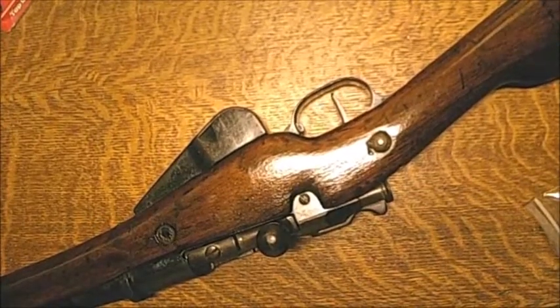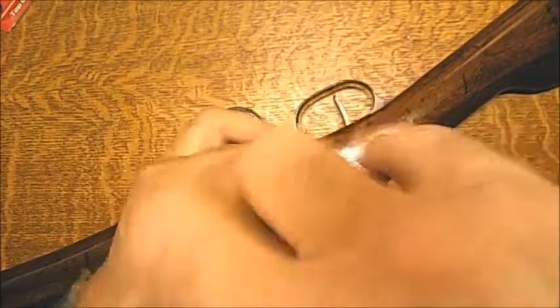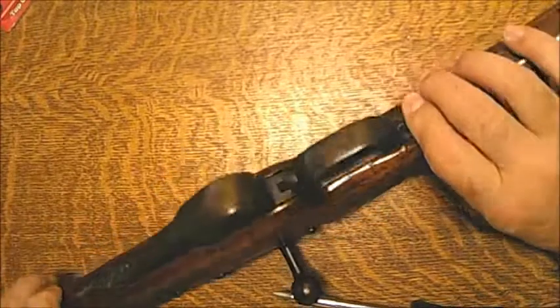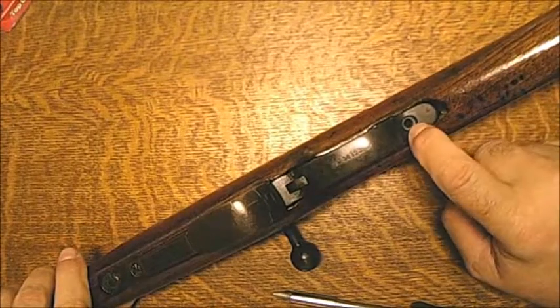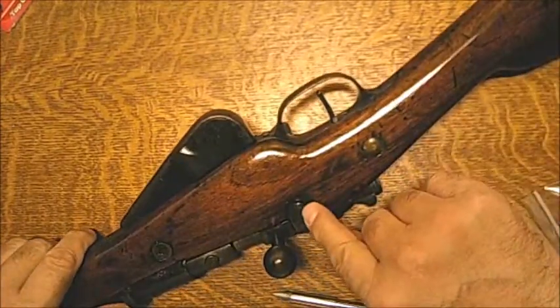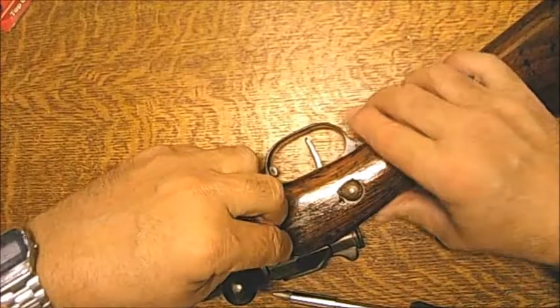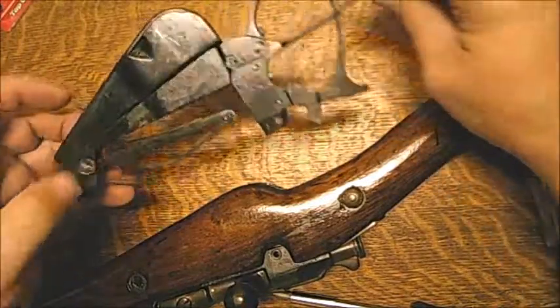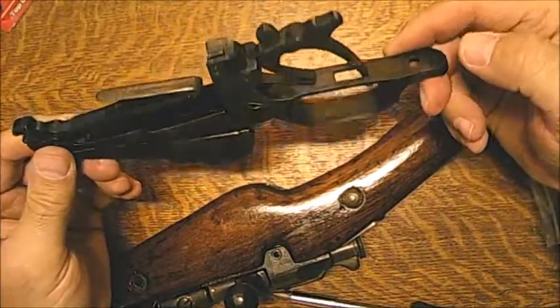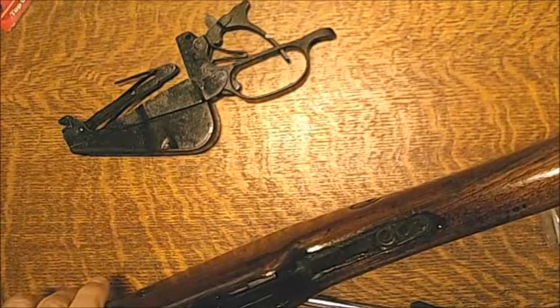If you want to hang around a little bit, I'm going to take the gun apart and replace some of the screws. Now, this one has some pretty interesting stuff in it. This whole assembly comes forward and just pulls out, and it's held by the screw in the back. But there's also this screw, a combination of a screw and a pin, that goes all the way across the firearm and holds this thing in. If you take that out, this starts to pop right out, and your whole fire control assembly and magazine assembly comes out as one piece, and that's pretty cool. But you have to get that out in order to get underneath here to get the tang screw in.